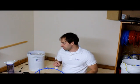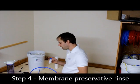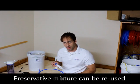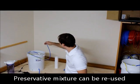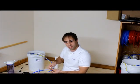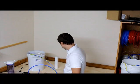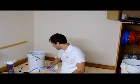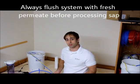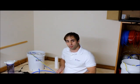If you're not going to be using it for two or three days, it's a really good idea to put it in a state of preservative. We recommend our membrane preservative — this mixes with a gallon of water, and you can run that through the system for five minutes, recirculating it. That would look like: take your intake suction hose, place it into a gallon of water, place your permeate outlet and your concentrate tube in the same gallon of water, and just let it run for five minutes. Another option if you don't have our membrane preservative on hand is three percent hydrogen peroxide from the grocery store or drugstore. Dilute that with a gallon of water — you want to get it down to 0.25%, which means roughly a little over a cup of that three percent hydrogen peroxide added to a gallon of water. You can also do that to preserve your membranes between uses when it's going to be sitting for two or three days.